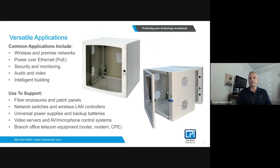Now that's important to know and understand because the UL 2416 requirements are fairly strict with respect to load ratings. Whatever a manufacturer advertises the load rating to be, it must be tested to 4 times that amount without catastrophic failure. So, even though this is literally a 2-foot tall box, we have over 1,000 pounds loaded into it and hinged away from the wall, and it passed with flying colors. That's a really key, important aspect to consider when looking at load ratings. Always look for that UL 2416 listing.